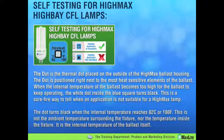In the past, it was a difficult process to get full warranty approval on enclosed fixtures — we'd have to get our hands on a fixture and run thermal tests. But we have evolved to a point where we can add this label: ThermMax. ThermMax is an irreversible thermal indicator — once it reaches a threshold temperature, it changes color. For enclosed or questionable applications, get a sample through your local sales rep, install it in the intended application, let it run for at least 100 hours, and then check the label. We want to ensure the most heat-sensitive components don't exceed the maximum temperature threshold for expected component life. It also makes warranty issues very simple: if the label shows the application was good, it becomes a no-questions-asked warranty. If the label turns black, we need to talk, because the application was obviously too hot.